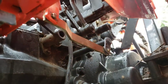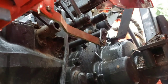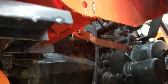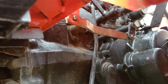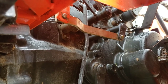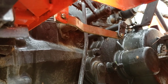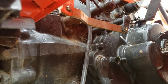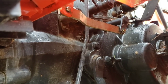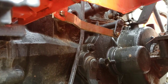Popped right in there. I can see when I'm pushing on it — I don't know that it's going to be the strongest, but it is going to work again, I'm sure. But I might think about making a reinforced or stronger one of those, maybe a piece of square tubing instead of just that flat bar. Or I could probably even just weld another flat piece the other way to make it like a T-shape to reinforce it. But we'll see how this works out.